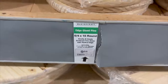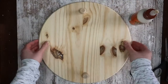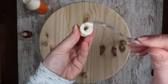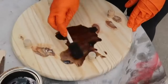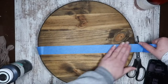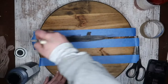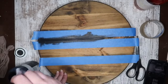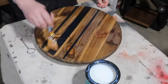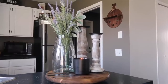Also super functional and stylish is this 15-inch wood round riser. I grabbed the circle from Menards but any hardware store carries it, and you'll also want some legs — I'm using finial caps from Walmart. I attached them with some wood glue onto each of the legs and put something really heavy on top to let it sit and stay. I stained the entire thing, and after that I used some painter's tape once the stain was fully dry to tape off and paint some black lines. You could add a name, a stencil, or hand-write on something, but I just liked the simplistic black lines. Once you seal it with some polycrylic, this thing is great for gifting as a candle stand or decor piece.